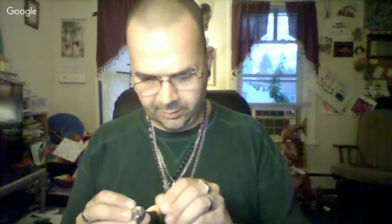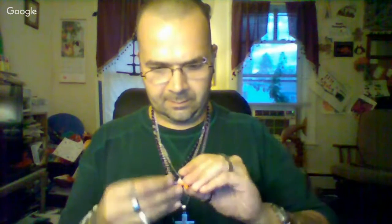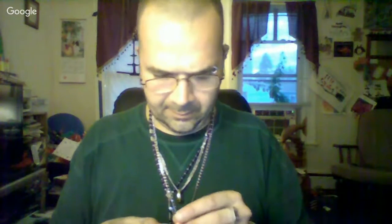All right, let's try to drop these leads in here somehow. I got this side in. Basically, what you want to do is take this off. Make sure your screws are open enough for your leads to fall in. There we go. We're going to go ahead and tighten this side. All right, we got one. And then we have this other one we got to do.